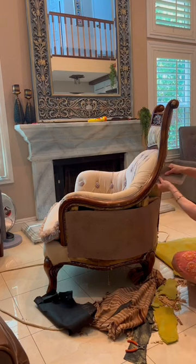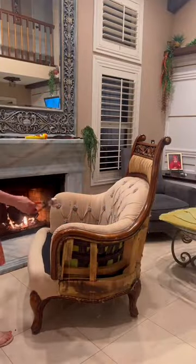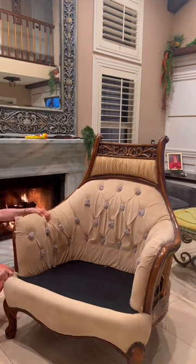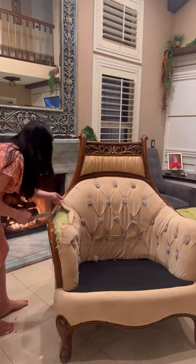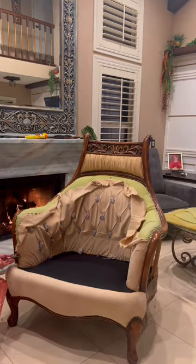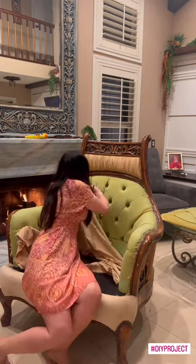This is a cardboard they use for the sides as support — I removed everything in a pack, as you see. Now I'm cutting the threads, removing the pillow, and starting with the inside couch the same way, just grabbing and pulling. This work needs some patience, it's time-consuming, but it's something we have to do for a complete upholstery flip. As you see, this couch is tufted but they didn't use buttons.